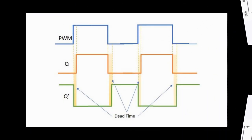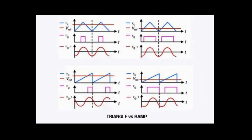Controlling dead times becomes easier too. A more sophisticated PDM generator for high-power AM usually puts a small amount of time between the required switching edges for the top and bottom switch. This is especially important for multi-switch totem pole type systems. This time is called the dead time. With the sawtooth, there's going to be some delay as the waveform peaks, then goes back to zero. During this time, you'll get some distortion in the output. So generally, we prefer to use triangle waves for our PDM clock.